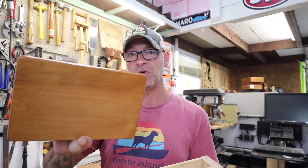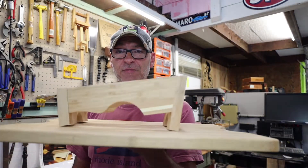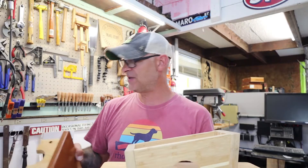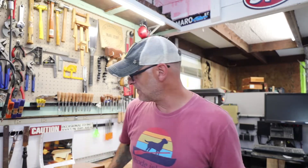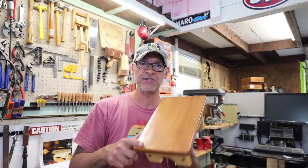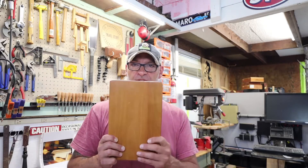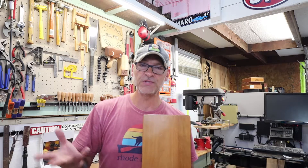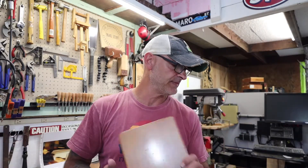Normally the top I use a different, more durable wood like oak that will withstand the feet, scratches, and dents — and it's a good contrasting color to the maple. If I were to keep the same wood, I'd include the top in the CNC cut list and cut everything at once, adding only about three extra minutes to the cut time. If I use a different type of wood, I have two options: load up another file and cut it on the CNC, or cut the rectangle on the table saw and route the edges. That would add about 15 to 20 minutes of tool setup, sanding, and routing with a handheld router. So food for thought.